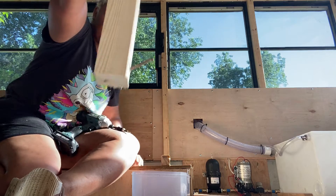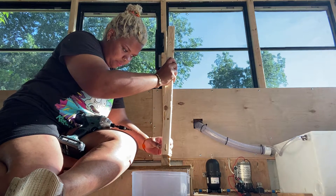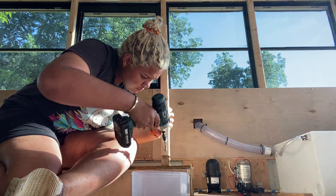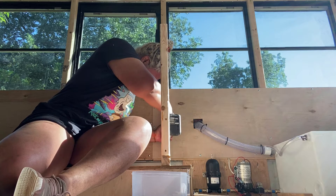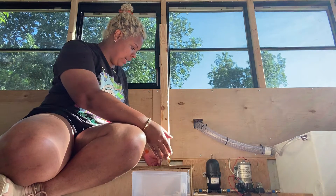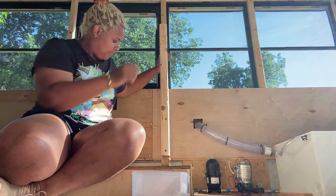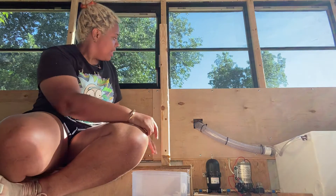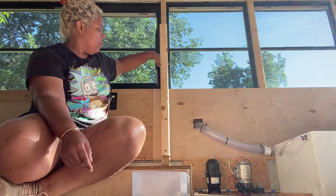He'll kind of get it through first like so, and then once it's looking like that, that's when he'll get it ready to screw in. Just to recap: we have our 21-inch on the bottom — I screwed it in with two screws into the wheel well itself. Then we have our 25s here — I screwed angled screws down into our 21-inch, then a screw going into the framing of the window, another screw going into this framing here, and another angled screw going up here.